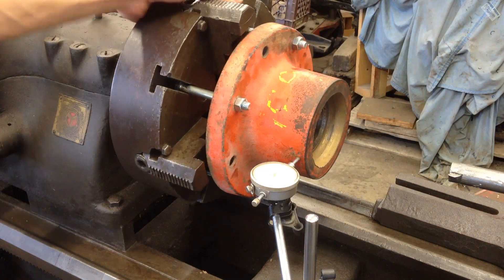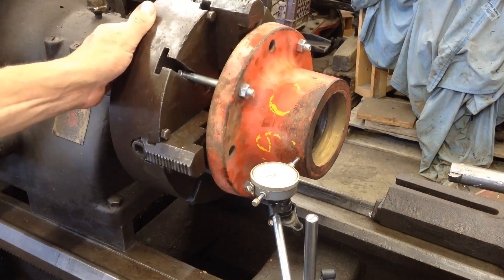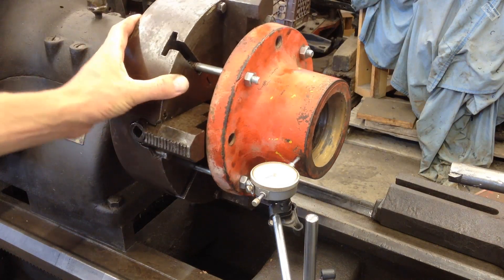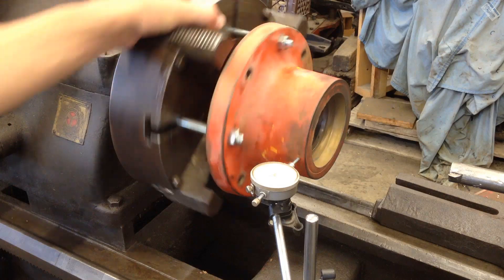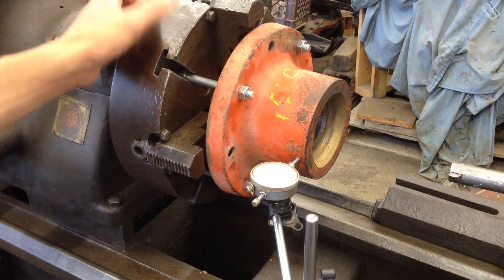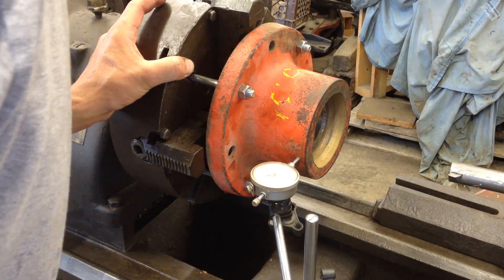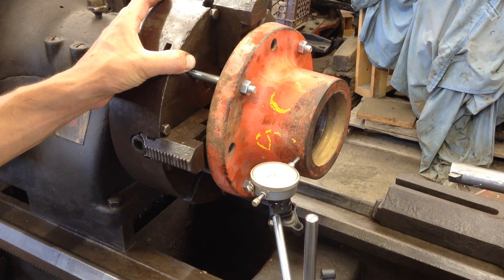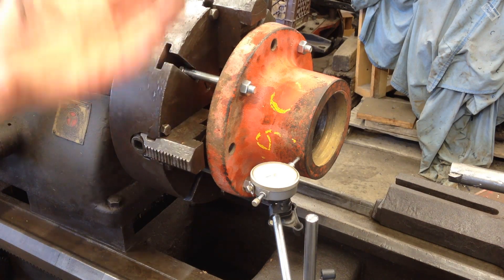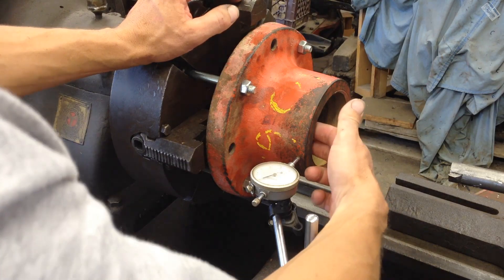I'm off a little bit, but this is just a casting I'm reading on out here. I'm trying to decide what's acceptable. It feels like there's really a low spot right there — jaw to jaw that's basically 39 to 40 thou. I moved the indicator back and I'm reading 42 and 41, so I'm really darn close. I'm going to try to read inside the bearing race next.